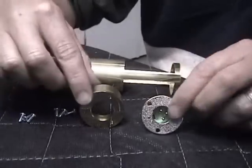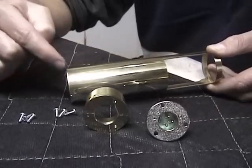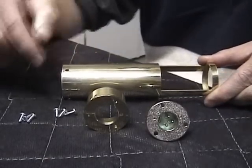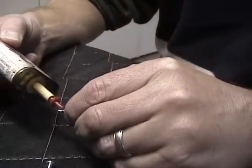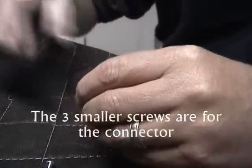What we're going to do is put the C3M connector into the chassis plug and then tap the holes in here for the chassis. It's a good idea to put a little bit of oil on the threads before you start to screw them in — just a tiny bit — that will help loosen the friction on the cutting threads.